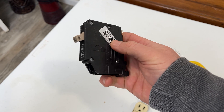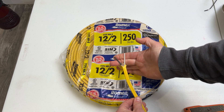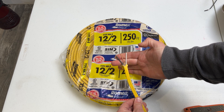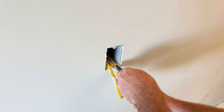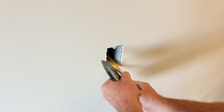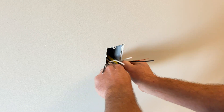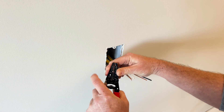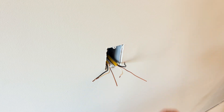Since I'm running my outlets on a 20-amp circuit, I'm using 12-2 Romex with a yellow jacket. Each electrical box — aside from the last one in the circuit — will have a pair of 12-2 Romex wires running to it. For each, carefully strip off about six inches of the yellow outer jacket and remove the paper inside. Then follow the directions on your wire nuts or wagos — whatever you're using — to strip the correct amount of insulation from each wire.